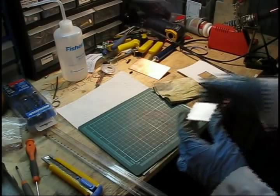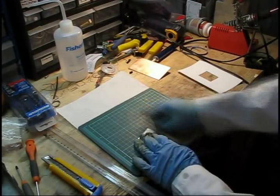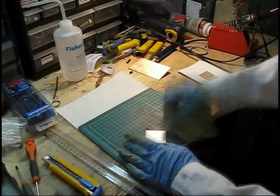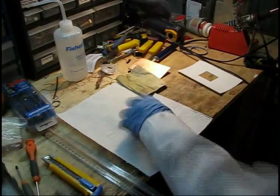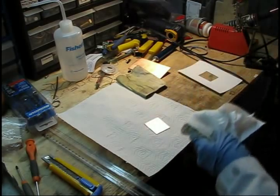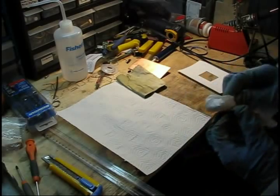So once you've got your copper clad prepared, just double check that you have. You want to sand in both directions perpendicular to each other and make sure that you've sanded off any material such as a sharpie marker. Once you've finished that you can put away your cutting mat and work on clean paper towel. Another thing to do is just quickly clean the surface using a little bit of alcohol — 99% isopropyl works — and just give it a quick wipe to remove any of the dust on the surface.